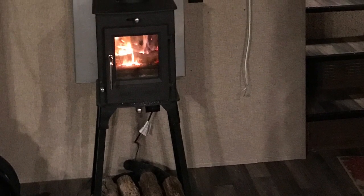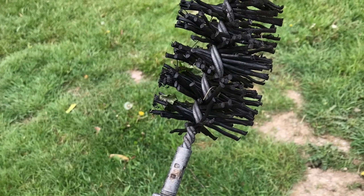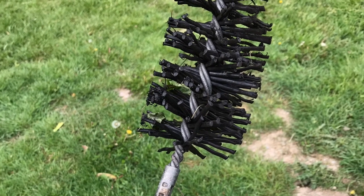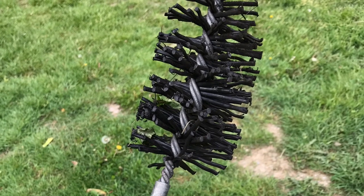The place I purchased the stove from is tinywoodstove.com. If you have a wood stove you need to sweep your chimney. This brush was for a 6-inch flue pipe and I have a 4-inch, so I took a belt sander and sanded it down to fit, then mounted it to a PVC pipe.